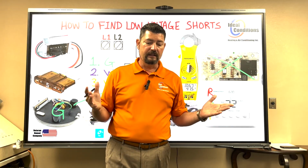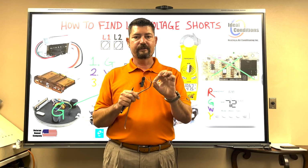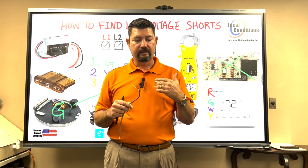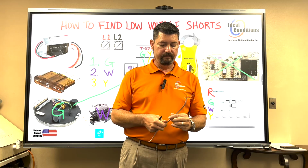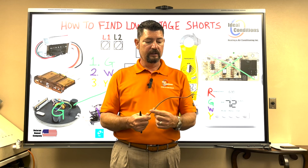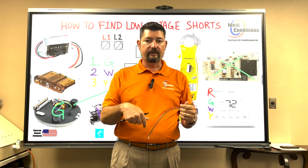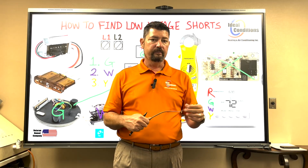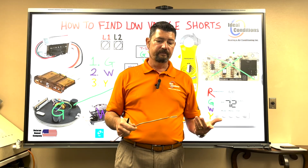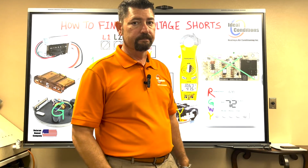Another thing too, if you see a low voltage wire coming out of the ground that's all beat up and frayed, and you see exposed wires, don't just electrical tape it. Cut it out and make a good splice. Maybe sleeve the new wire in a half inch or three-quarter inch Seal-Tite, or some Carflex, so if they have a lawn company that's a little abusive to sensitive stuff like this, it's better protected. Help your customers. Be the hero. They need it, and you need them.